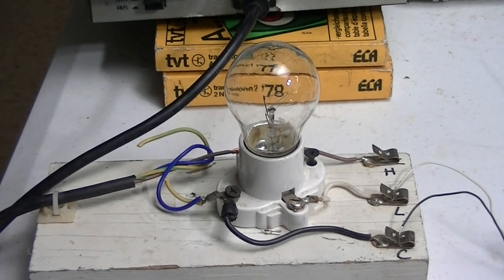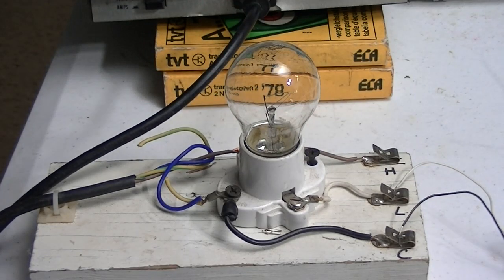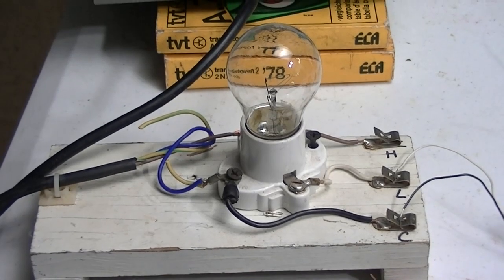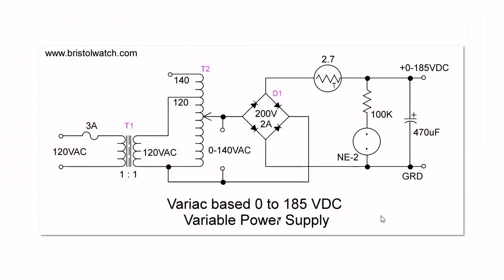This supplies variable voltage adjustment to keep from damaging your test equipment — if you get a hot ground mixed up into your oscilloscope ground, it's going to damage your equipment. What I call my load lamp is a small light bulb in series with the power input to my voltage generator board. It's a quick and dirty current limiter — if I short something out, all I'm going to do is light up the light bulb. I'm not going to blow any fuses or damage my variac. If you're going to do these kinds of experiments off the 120-volt line, get an isolation transformer and use a load lamp.